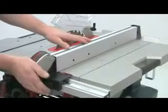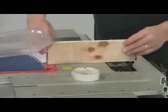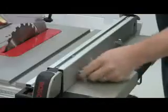The rip fence is particularly large and rigid and for accuracy uses the square lock system which automatically aligns the fence true to the blade. The V-block locking mechanism is strong but easy to operate with one hand and secures the fence at the back as well as the front. The flat section of the fence means you can fit your own wooden sub-fences or jigs if required. For narrow ripping cuts or bevel cuts the supplementary spacer attaches to the rip fence with three wing nuts. A magnifying cursor on the fence allows you to set the ripping width precisely, and the multiple scales work either side of the blade and with the extension open or closed.